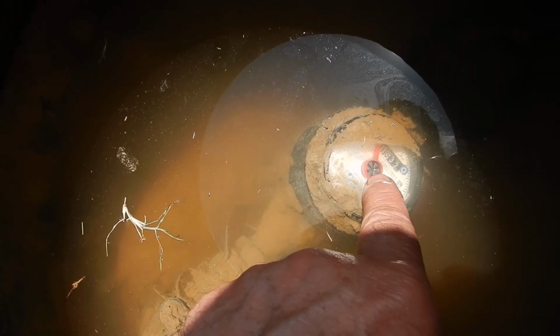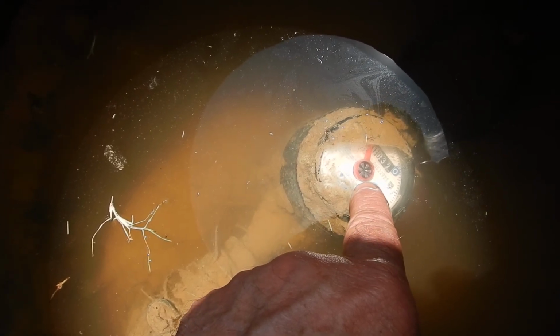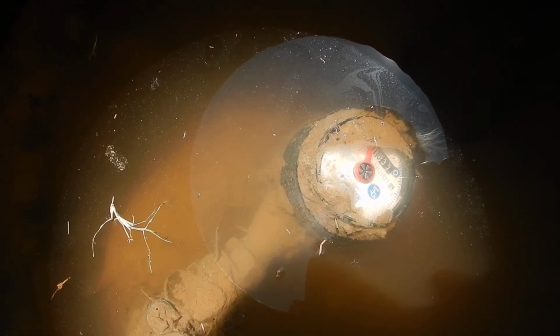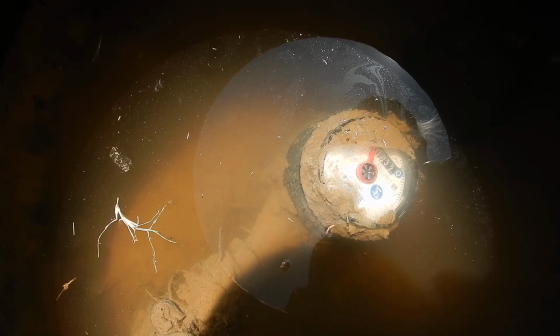So that's what it is. It's very sensitive. You could have a leak that's so small it doesn't register on this, but it's almost impossible. So if that wheel is moving, water is moving, fresh, potable, drinkable water into your house. You've got a leak somewhere. The dishwasher's running, you've got a leaky flapper on your commode. Somewhere you've got a leak. And if you don't have a leak that you can see, and that's moving, you have a leak that you cannot see.